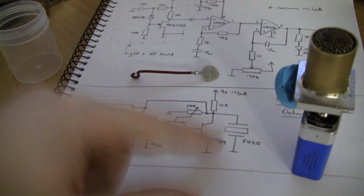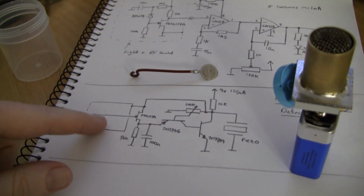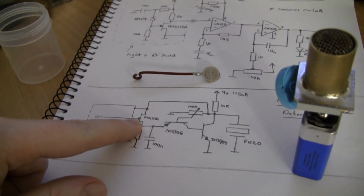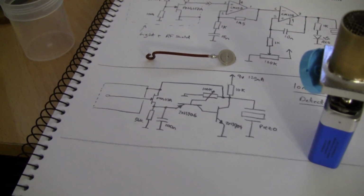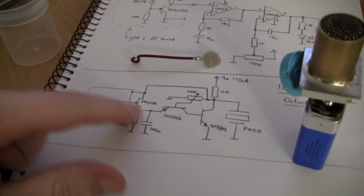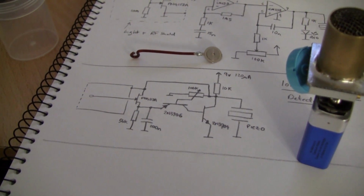When the entire thing stabilizes and cuts off, the voltage across this piezo is removed very quickly, so there's a nice click, and then the circuit will charge back up once it recovers, and the voltage on the gate here has been discharged through the gate source diode, which is a little unconventional, but at these currents it's not a problem. The capacitance here is quite small, and the peak current's very tiny. It's well within the allowed current of the gate source junction.